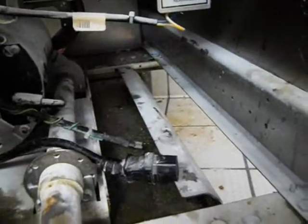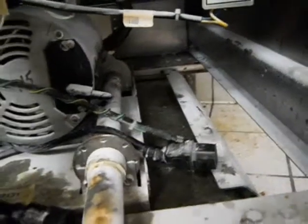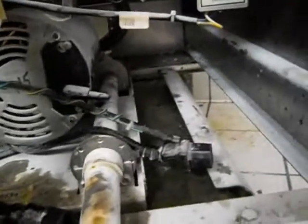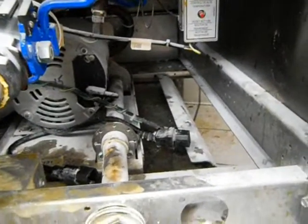There's no space to get it out between the motor and the frame. There's no space between the pan rail and the outside. There's no space. You've got to remove this pump and motor to get this transformer out. Now look at all the space over here. There's like 8 or 9 solid inches of clear space. If they'd have just put it over here, hey, I'd have been done. Now, I may have to replace the back hose because it's leaking. There's another $250, all because that little tiny fuse in the transformer blew up. This fryer is an amazing piece of ridiculous.